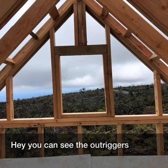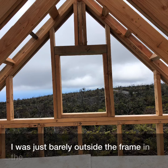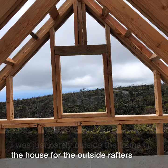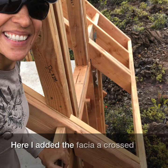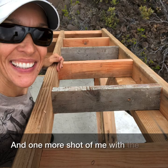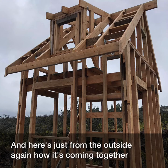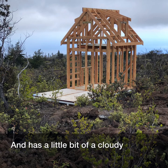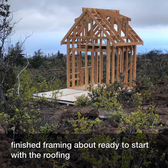Here you can see the outriggers. I didn't do an extremely long outrigger — it's just barely outside the frame of the house for the outer rafters, as I didn't need a really large overhang. Here I added the fascia across. And here's from the outside again how it's coming together — pretty much the finished framing, about ready to start with the roofing right after this.